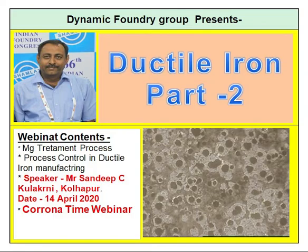So 1430 will be my first box temperature. So you have to calculate these things: temperature loss in treatment and temperature loss during the transport. So you can get that particular loss in your own foundry. This is what I have calculated in our foundry.